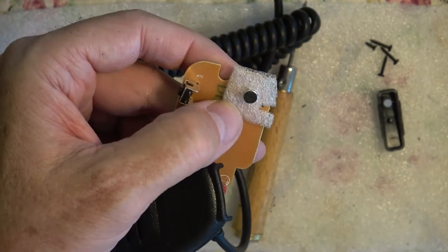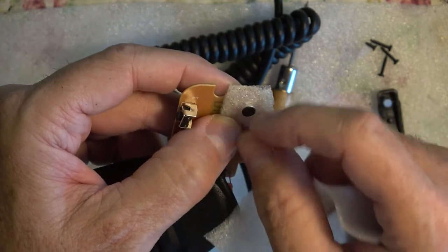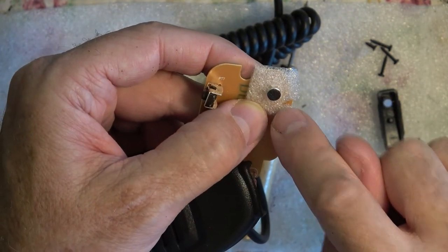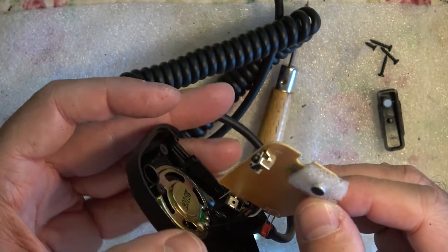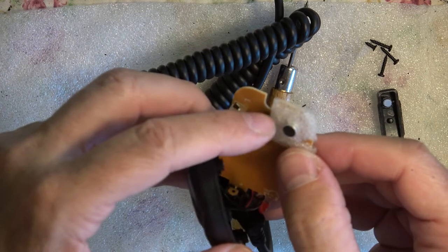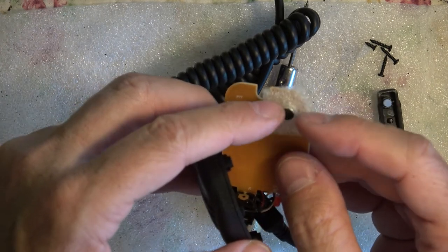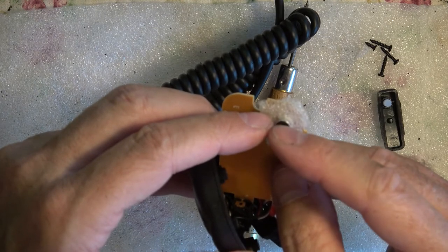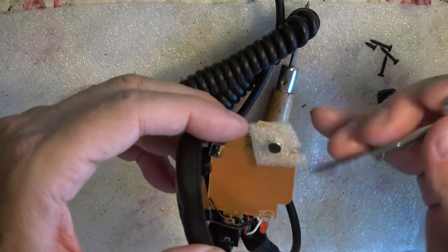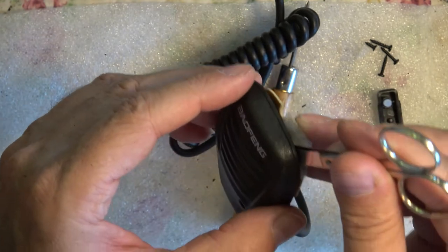What we're going to do now is do the same thing over and over again three times. We're going to lay another one over the top of this and do the exact same procedure, then take that off and put another one on and do the same procedure so that we have three of these layers here. Then we're going to very carefully put the microphone back in with the three layers. I've already got one that I've put together with three layers. But make sure when you do the three layers and put it back together, you don't let one of the layers cover the microphone itself. You're going to have to hold that in place while putting it back in — often I'll do that with a pair of scissors to keep the foam from getting on top of the microphone element while putting it back together.